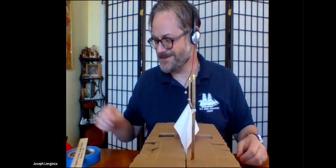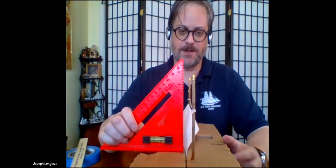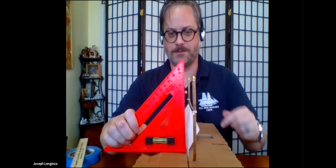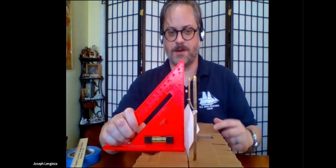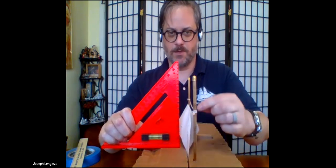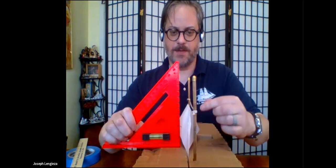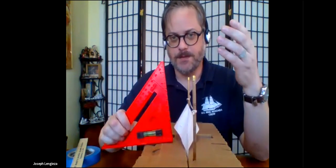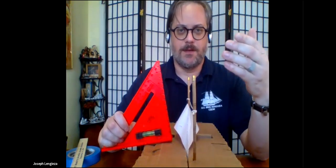I've spent many hours doing this, but not usually this small. So measuring out from the grid, you establish points fore and aft, up and down, and in and out. So just making a grid, 1, 2, 3, 4 down, go back a station or a unit, count down, measuring distance out every time. And by doing that, you establish the point space which you'll be making your drawings out of. We build aircraft the same way. I don't know if that makes me feel better or worse.